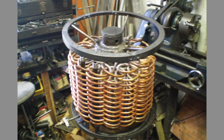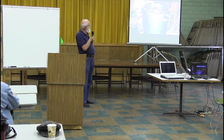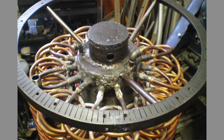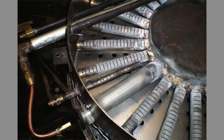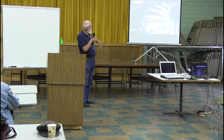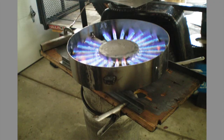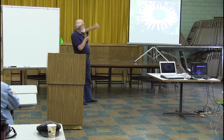I raised the top, and I might have to change that a little more because I felt where the tops would be coming in, she would be right where the steam would be coming out. That's my economizer, and the sheet metal around there is just plain to kind of hold things in. That's upside down — looking at the bottom — and that was the metal going around there that I had took out because that wasn't doing it. There's my burner. Hacksawed all of them, my pilot light next to my mixing tube. So far, pretty good. This is firing with propane. Propane always burns real nice — if your slots are below 30 thousandths, you don't have a problem with a flame trying to jump inside, and it seemed like it got a real nice burn.